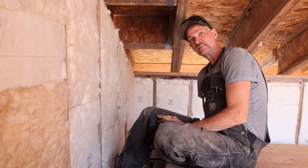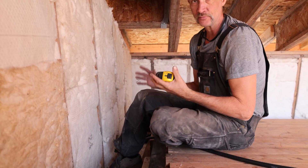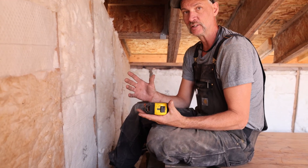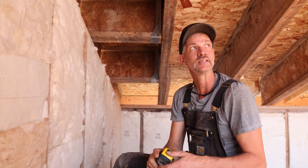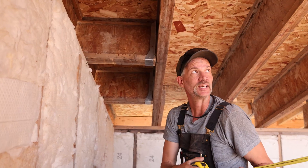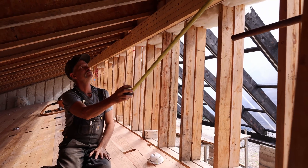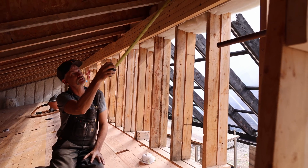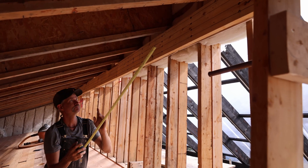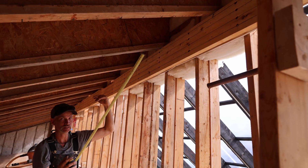Below me here is where we have our manifold for the climate battery. I've also picked up a bunch of spiral ductwork, and that's going to come up through this section of roof along the slope of this ceiling. Then we're going to come along this beam with the spiral ducting, and it's going to have six different plenums essentially that are going to be pulling the hotter air down from the hot side of the greenhouse.